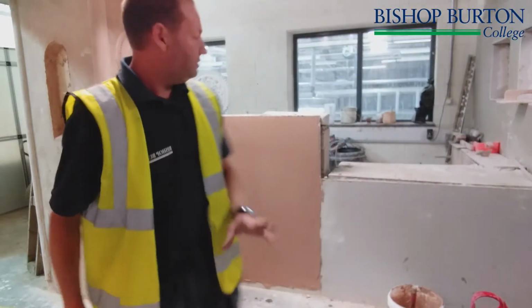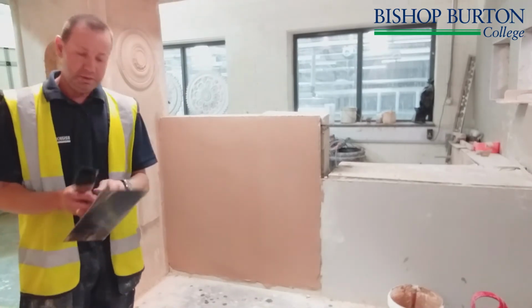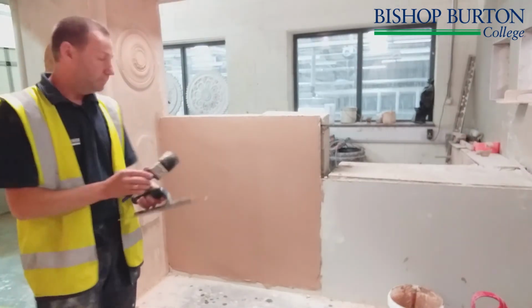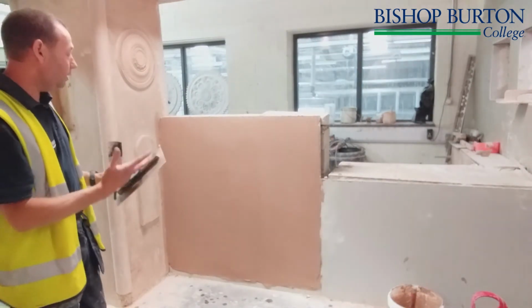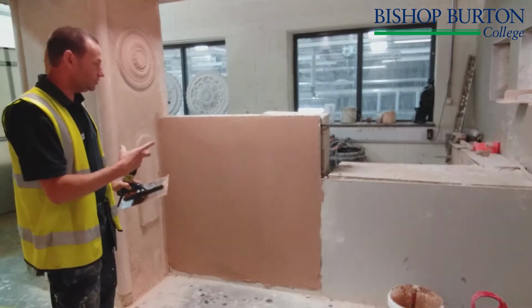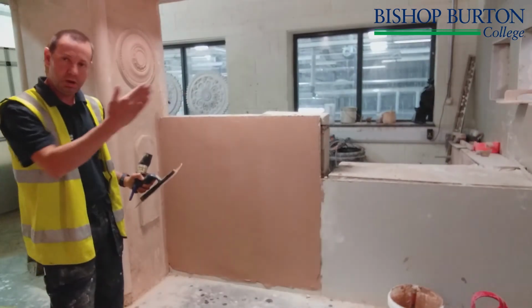Okay, so give it a bit, it's about maybe 10-15 minutes now. So all I need now is just the paintbrush and then my trowel. And all we're going to do now is just trowel it up. And all that means is we kind of crisscross it. So when we put the plaster on, we went up and down. When we're troweling it up, you can also go horizontal.